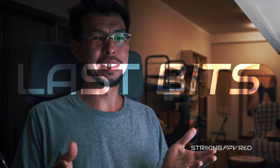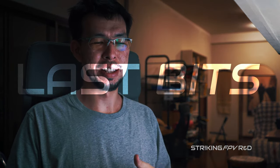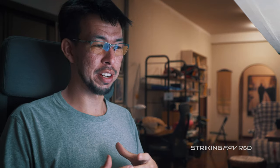Thumbs up. All right, number 10. So this is not a single question. It's just last little bits that some questions have come up. So no, you should not put a toroidal prop into a duct, because a duct is trying to increase efficiency by dealing with the wingtip vortices by getting really close up and trying to eliminate them. And the toroidal prop design is actually trying to do the same thing. So it doesn't really make sense to put a toroidal prop into a duct. So no need to do it. Unless you're just curious and you want to see how it goes, then by all means, go for it. It's all fun.